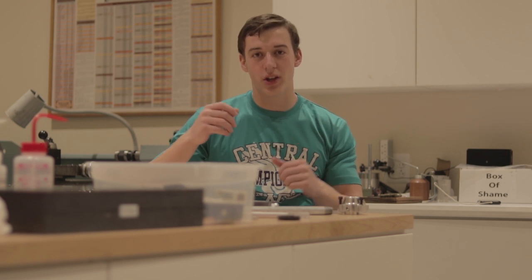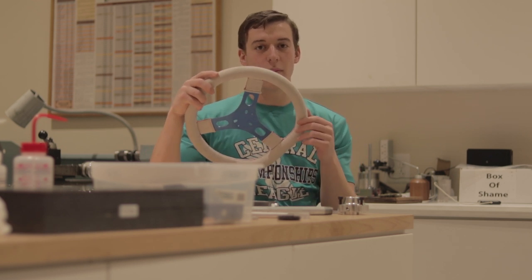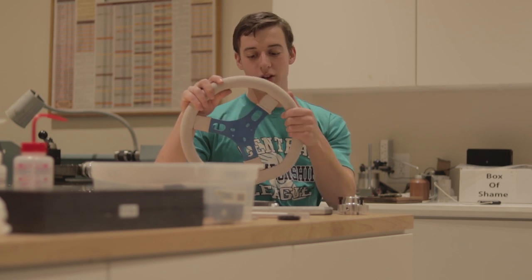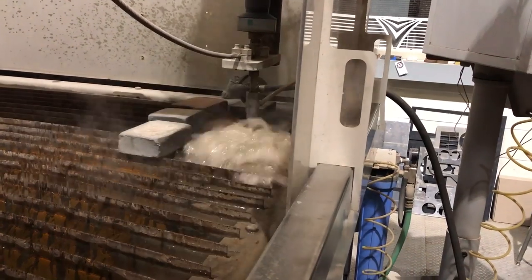So Reed got this half-inch aluminum sheet, and what we're going to do with that is make a clutch lever. And we're also going to machine a hub for the steering wheel that will connect to the steering column, but also have a mount for the clutch lever. And we're doing a butterfly clutch lever design, just a hand clutch. Similar to just a normal standard shifter cart.